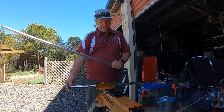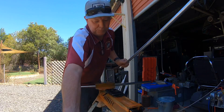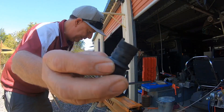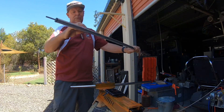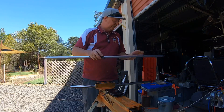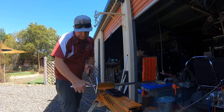So you've got to pull a cap piece out of the end here, which I've done. And I've had to grind the end of it off a little bit so that it fits inside here. Because that will go into the bottom of this leg when I cut it off. Basically it's just two cuts — I've already measured it out so I've just got to cut here.